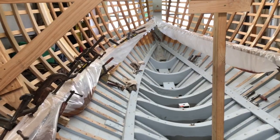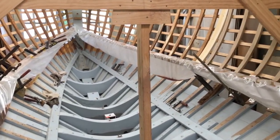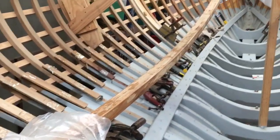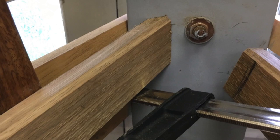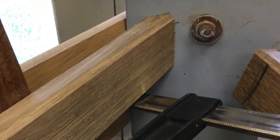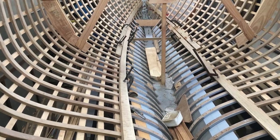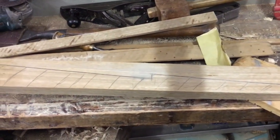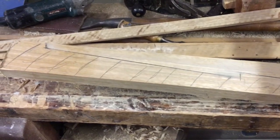There was a bit of edgeways bend as well, so I clamped blocks of wood strategically to bend around. Next day they came out of the bag, and after a day or two to dry, I trimmed the forward ends to fit, clamped the forward parts in place, clamped the aft sections, and marked and cut a traditional locked step scarf.